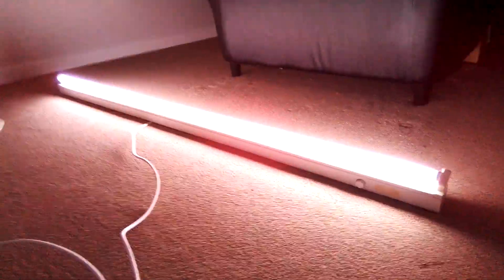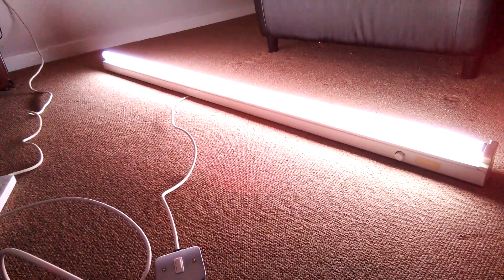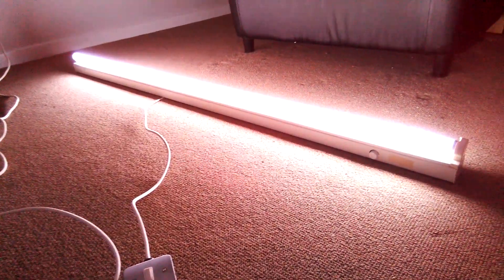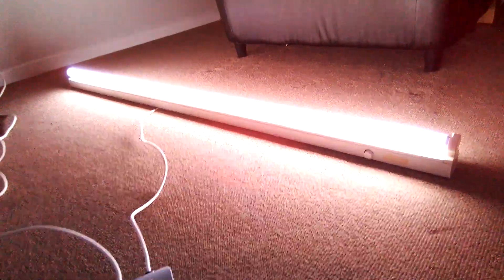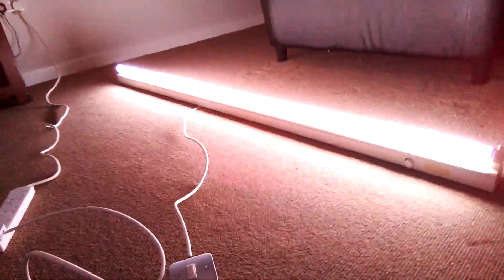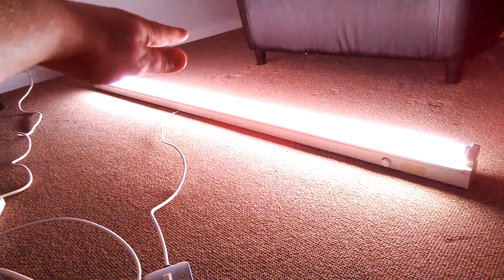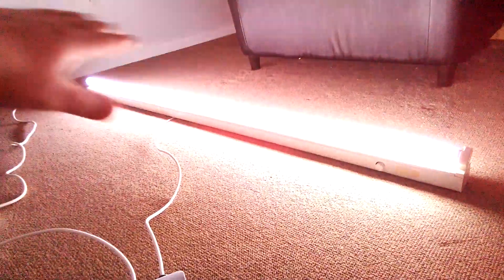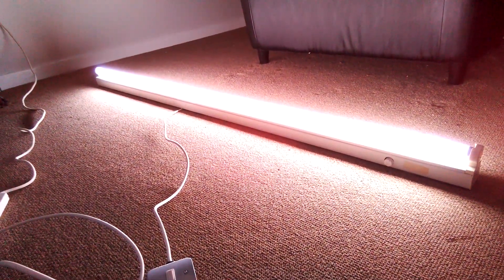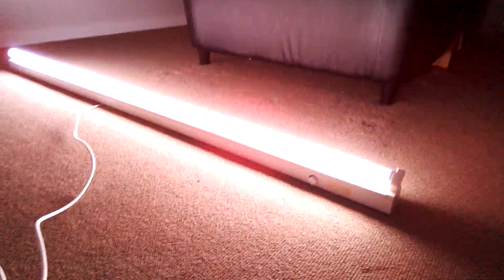Wow — it triggered the electrodes without flashing, it just actually comes on without flickering. I think it's the better starter button; it comes on more instantly — not completely instant, but it just comes on magnetically with the starter and the tube lights straight away without flashing. The middle part is getting brighter now but it takes a while because it's six feet long. I wish it was a T12 one because T12s don't do that, but T8 ones do.